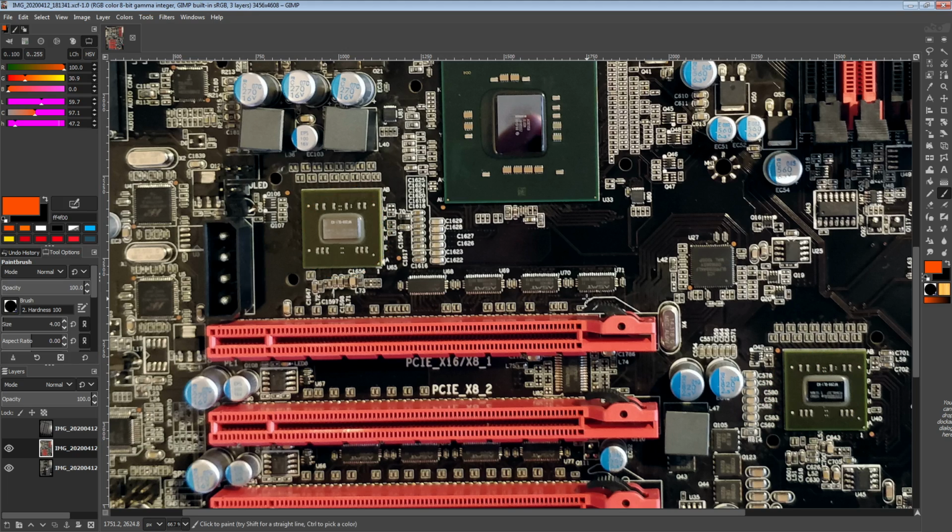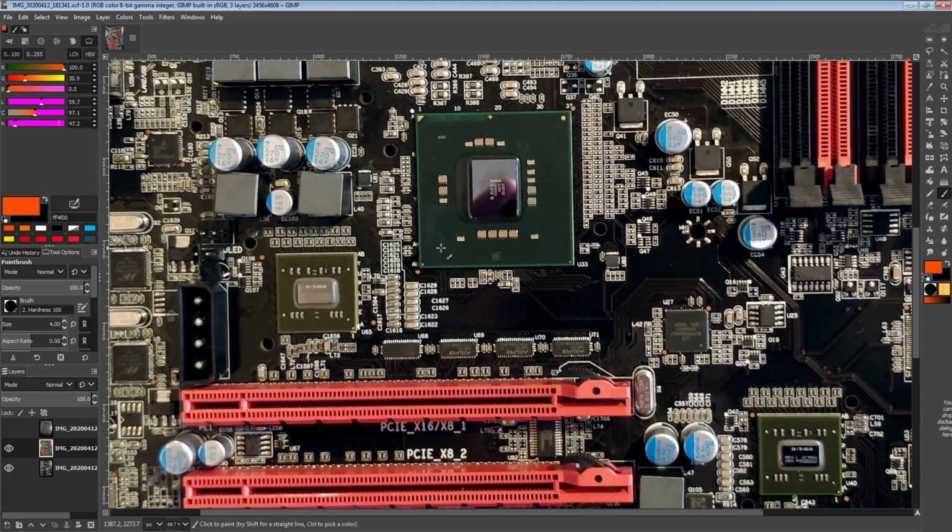Why do you need them? Because NVIDIA needs more money. That's why you need them. So X58 has 36 PCIe lanes coming off of the I/O hub over here. That's normally plenty of PCIe lanes for 4-way Crossfire. That's plenty of PCIe lanes for quad SLI on literally all the later platforms.